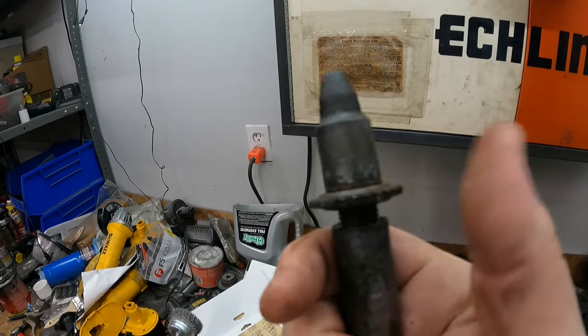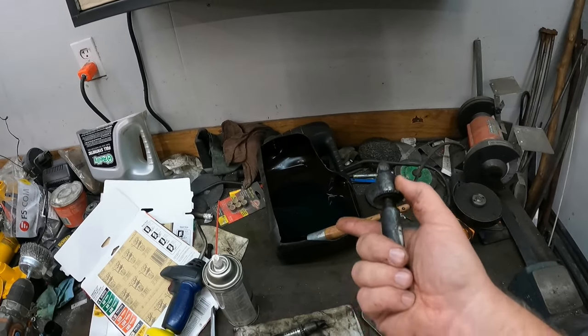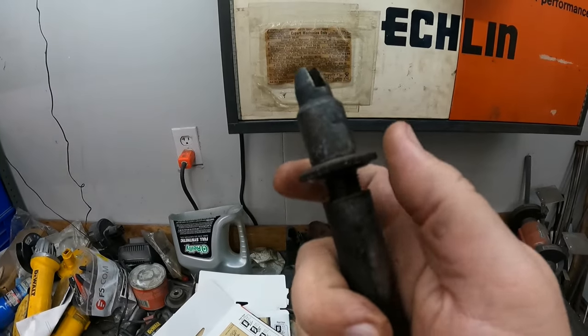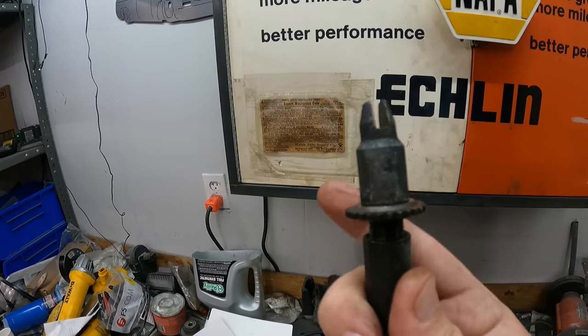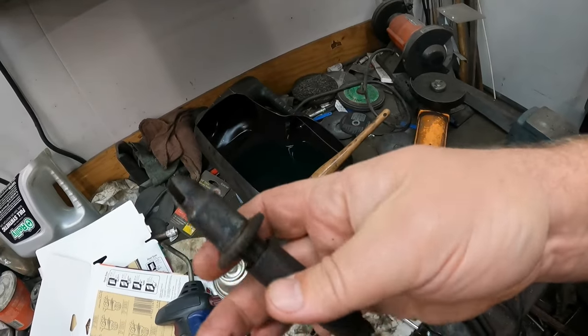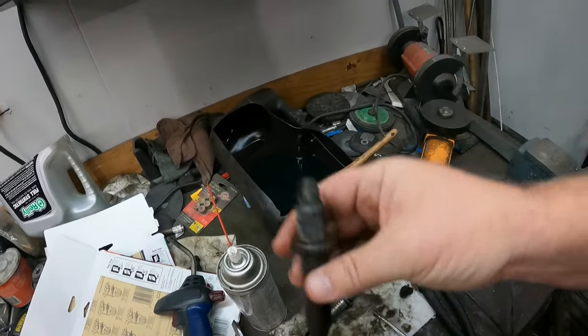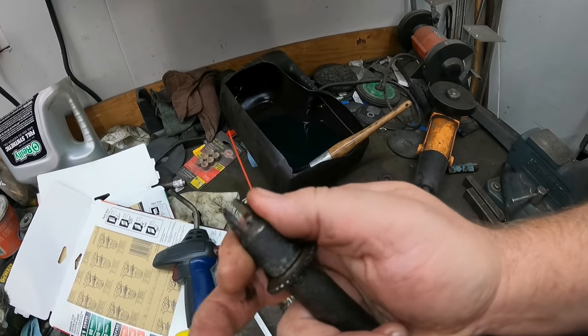The screw adjustment side was seized up too. I threw it in a tub of diesel and let it soak since Monday - that didn't really do anything. So I ended up getting out the propane torch and heating it until it was stupid hot. I stuck it in the vice and grabbed it with pliers and worked it back and forth, hit it with a little Freeze-All, and she finally broke loose. I took it completely apart and cleaned the threads with a wire brush - she turns really good and easy now. I just need to put some lube on the end cap to keep it from seizing again. That took about 20 to 30 minutes.